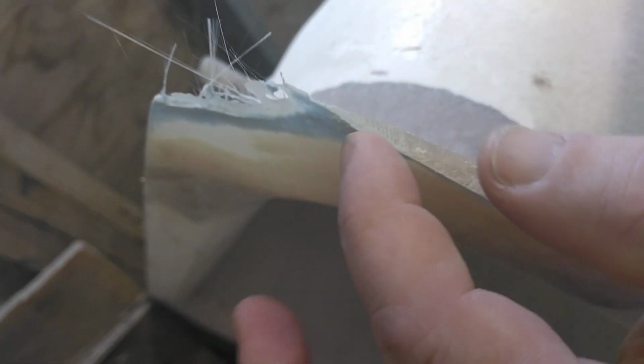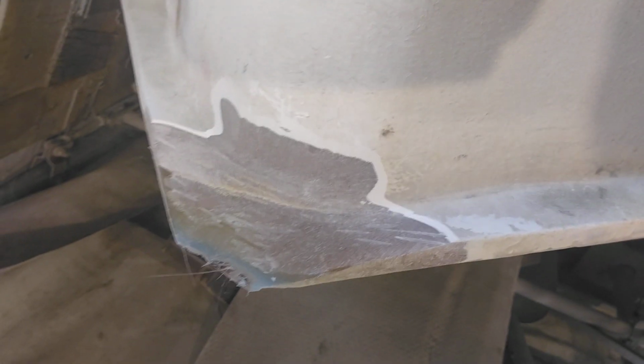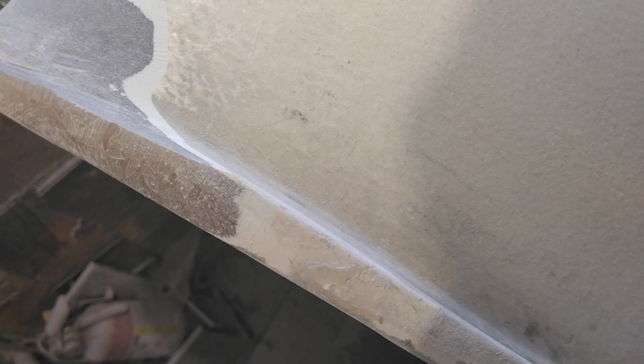What is up, guys? I am back on these bucket truck buckets. I've got this all ground out. I layered up the top layer here. I put some tape on one side and layered my top layer, so that way I've got a solid piece to form this repair here too. It's got a good, who knows, man, 10 layers of fiber probably to fill that space.